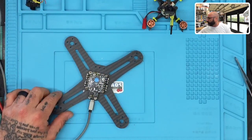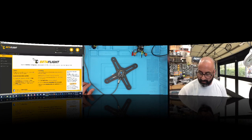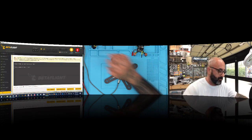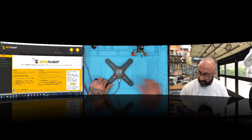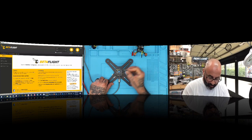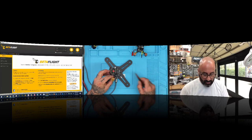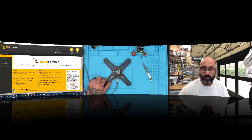I have BetaFlight here. Let me do a three-screen view. BetaFlight is up and everything looks good. I'm going to connect and type 'defaults' so that none of the old settings carry through — hit enter. What you want to notice is the arrow right here. This arrow points forward, toward the front of the quad. From the factory, the arrow is the reference point — every board usually has one, even this Multistar.